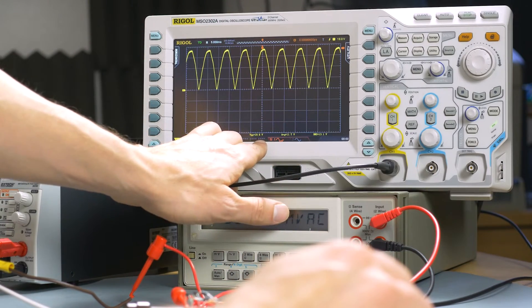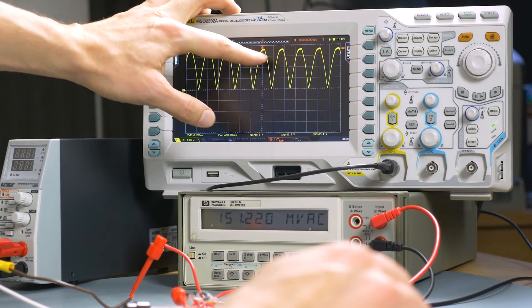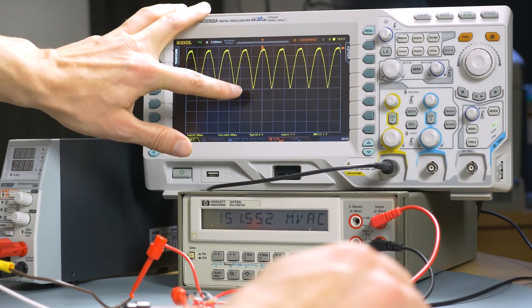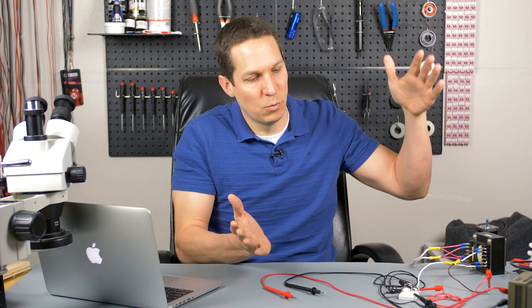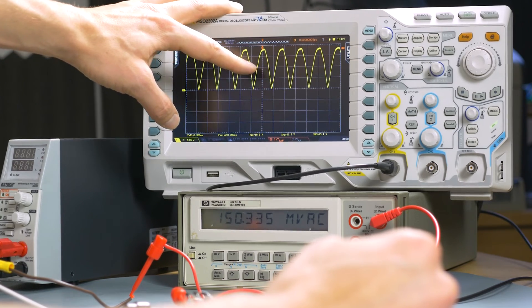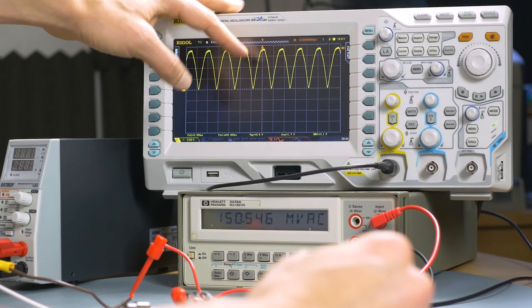You'll also notice I'm not only measuring the average voltage here, but also the peak-to-peak and RMS. The peak-to-peak is 18.4 volts — that's why I said 12 volts earlier with air quotes, because in reality you're getting quite a bit more than 12 volts, but once you take the average it drops down significantly. So we've got about 18.6 volts peak-to-peak, 11.7 volts average, and 13.1 volts RMS. When dealing with full wave rectifiers, you need to make sure you're measuring the correct thing. If you assume only 12 volts average and choose a component rated for 15 volts, but you actually have 18–19 volts peak-to-peak across it, you're going to damage that component. Make sure you're taking all of those measurements into account when choosing what devices to use.